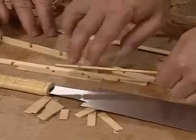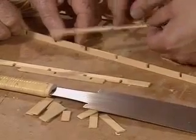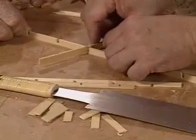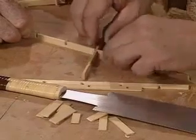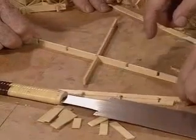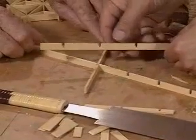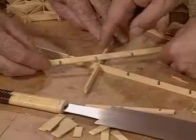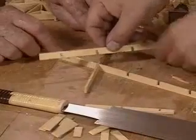The next piece obviously needs a groove for the top and the bottom. All right, so the third in the middle remains and lines up so that it forms a path for the top third. And hopefully all your shoulders line up. And then the third one is similar to the bottom. It's cut away two-thirds, but it needs a shoulder because half of it only goes a third of the way. I see. All right. So it's two-thirds in.